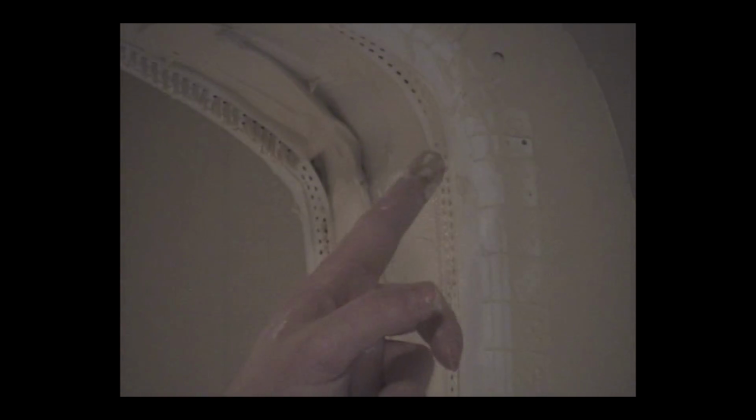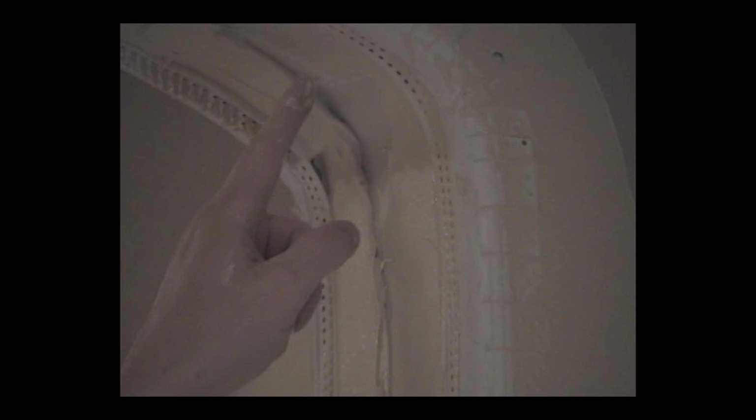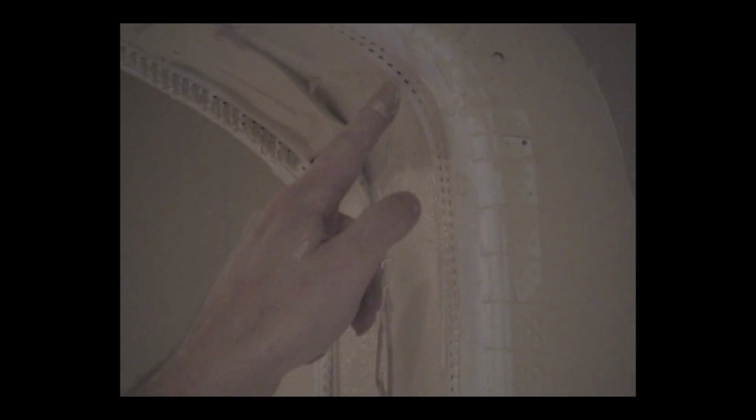When installing a corner bead, it's important to measure across both sides as you're applying your bead and wiping it down, so that once you put it where you want it to be, it doesn't shift. So it's very possible to use nails to just tack in these little areas here, not to put them all the way into the board or into the framing, but just to tack it to hold the corner bead and keep it from shifting. The only drawback is if you use masonite, it's going to be very difficult to get your nail to embed and hold in that masonite without using screws or something. But that way everything is consistent. The measurement across here is the same all the way down.